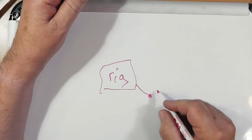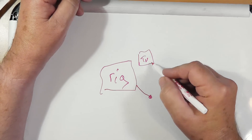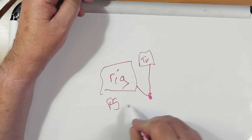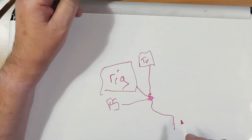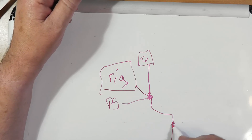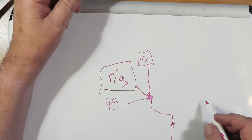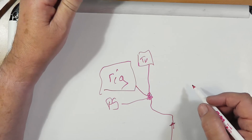You've got RF in the house. You do not talk about your grounding system at all. Your rig should be grounded to a spot in your shack. You've got maybe a tuner here, also grounded, a power supply, also grounded. And then from here, this goes outside to your ground rod, and this attaches here with a compression fit type of connector. This should also be all compression fit. I use hose clamps to do this.